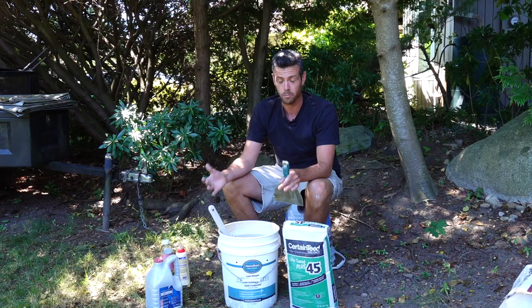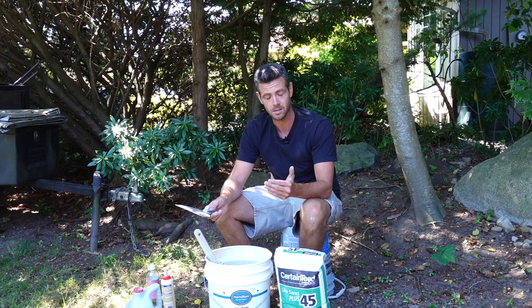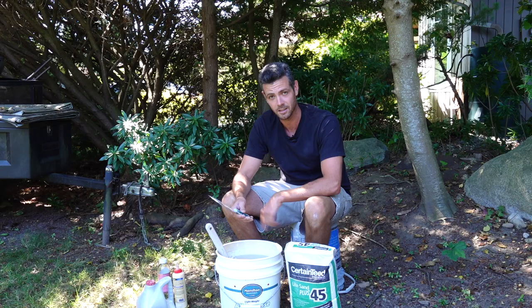What I'm saying is you're going to need to know your locally available products. If you aren't sure whether your quick set has good adhesion, it's not going to hurt to add some glue for your pre-fill and taping coats. Because I've had this particular product fail multiple times, I will be adding glue to ensure it stays on the wall and doesn't impede my progress.